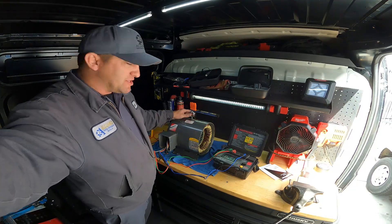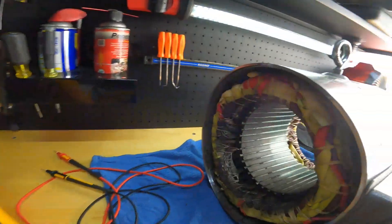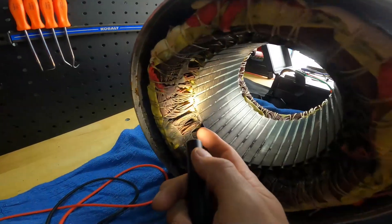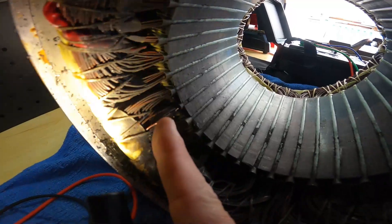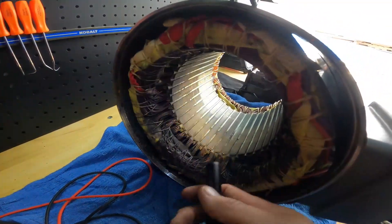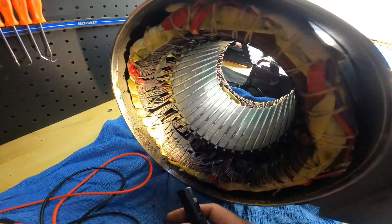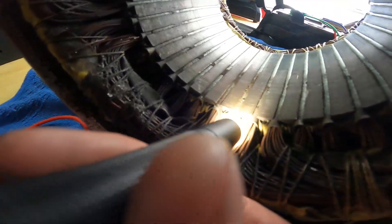The reason why this motor is at eight and a half percent is something you can physically see. Let me grab my flashlight and show you what's going on. You look here — look at that right there. It looks like it was nicked here — like a piece of ice got stuck on the fan of the motor. It has a little fan built into it, and it probably slung and cut this or nicked it. It did the same thing over here too — you can see that winding over there did the exact same thing.